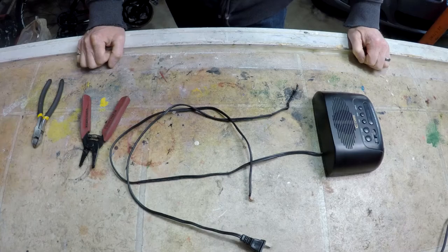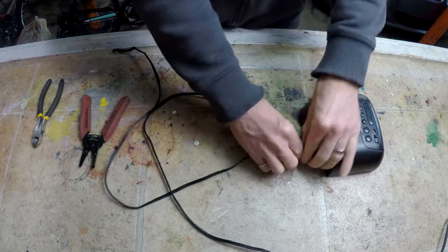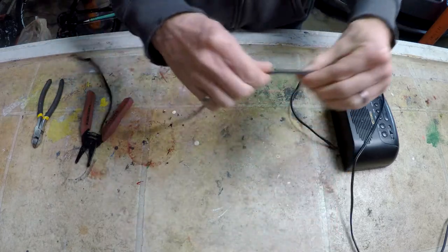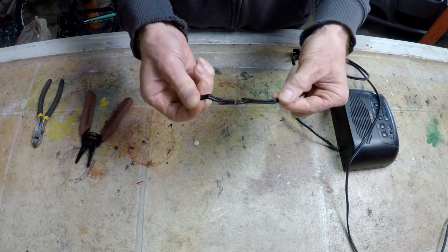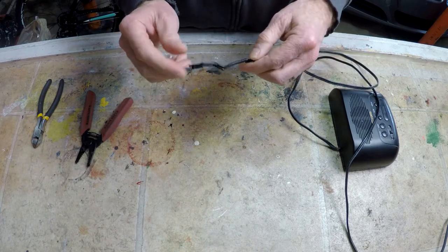So instead of throwing this clock away, we're going to repair the cord here. Checking the cord for damages, it looks like as we go down, making sure we check the entire length for teeth marks, we only have a very little bit that's damaged in this area right here. So instead of replacing the cord, we're just going to cut out this short section that's damaged and then splice